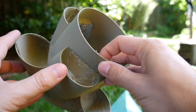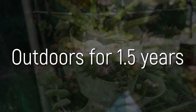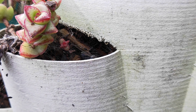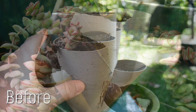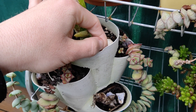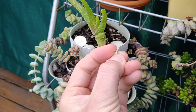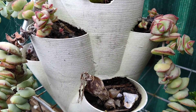This pot was planted up with succulents and exposed to the harsh Australian sun for over a year. It hasn't really fared that well. The print wasn't the best quality to start with, but what's instantly obvious is the bleaching which has occurred — going from a sort of army green to a sickly grey-green, much lighter in colour. It's also become more brittle over time with chunks just breaking away with your fingers, regardless of the layer lines. This does probably mean the material would biodegrade relatively quickly compared to other PLAs, if that's something important to you.